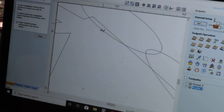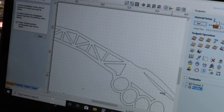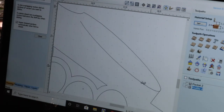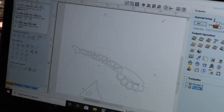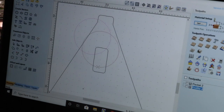Now I'm using a really interesting tool — you draw images over images or vectors over vectors and you can just clip away the ones you don't want. This is Vectric, the software used to design the cutting path. I use a ShopBot, but this particular software is used for a lot of different machines. And now I also have a logo placement, and I'm getting rid of that part I marked with the Sharpie marker.